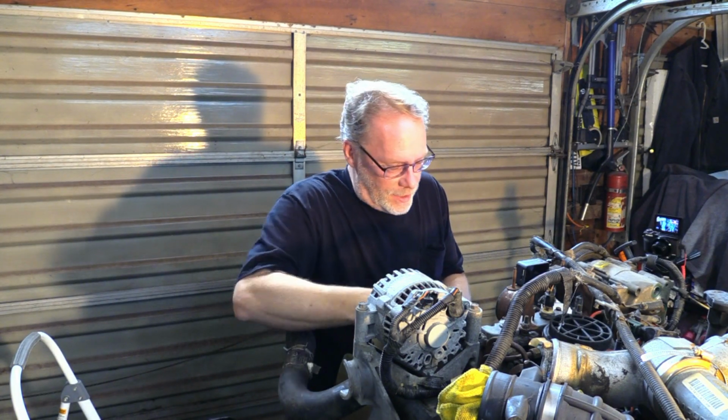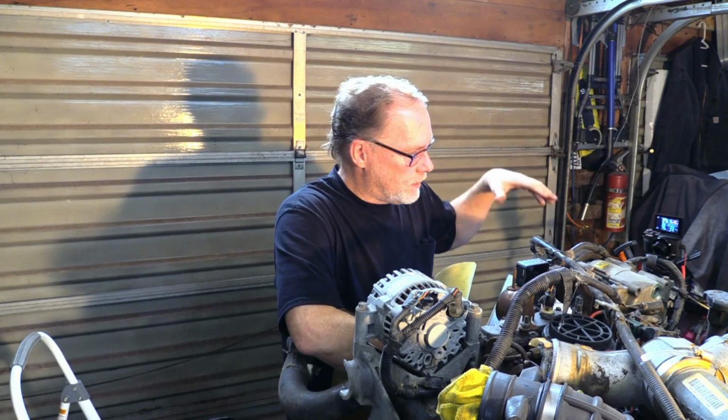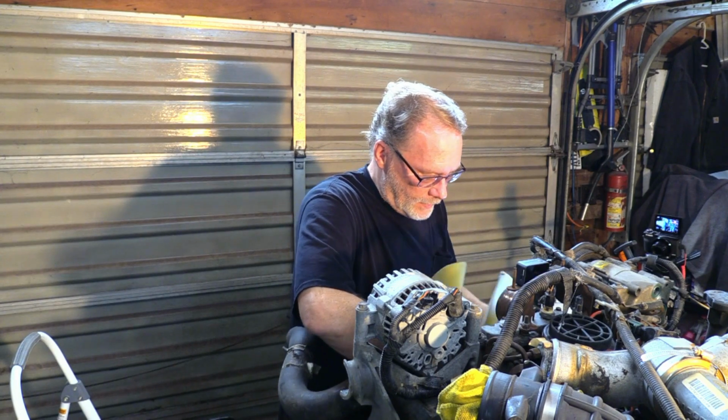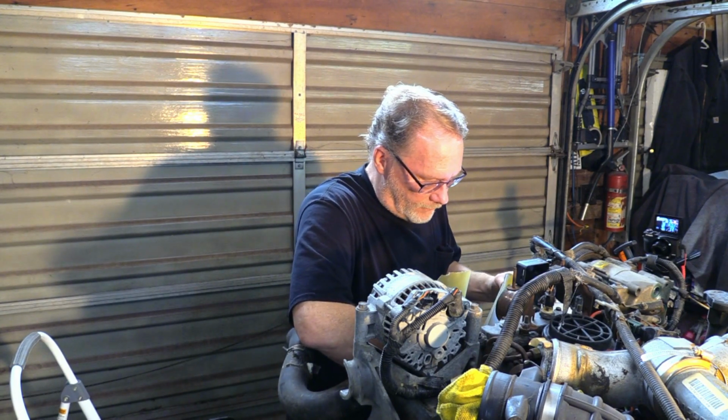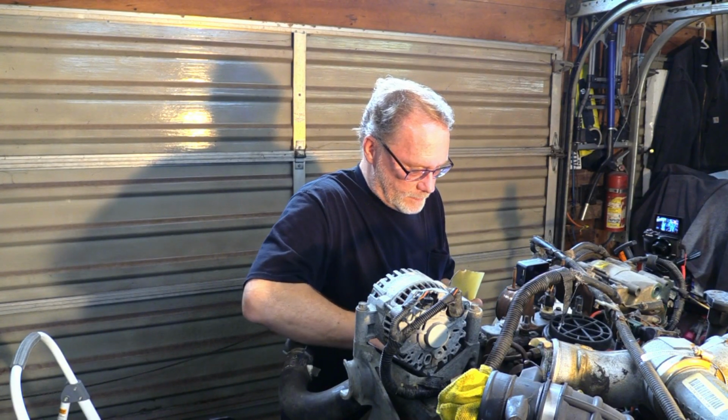So keep two hands on it. Now, if you have a water bottle that sits over here, that's three number 10s. Just take the bolts out, kind of slide that water bottle in over here. You don't have to completely remove it. But slowly slide it off, and you're going to start seeing this get a little bit wobbly. You're there. Make sure you keep a grip on it.